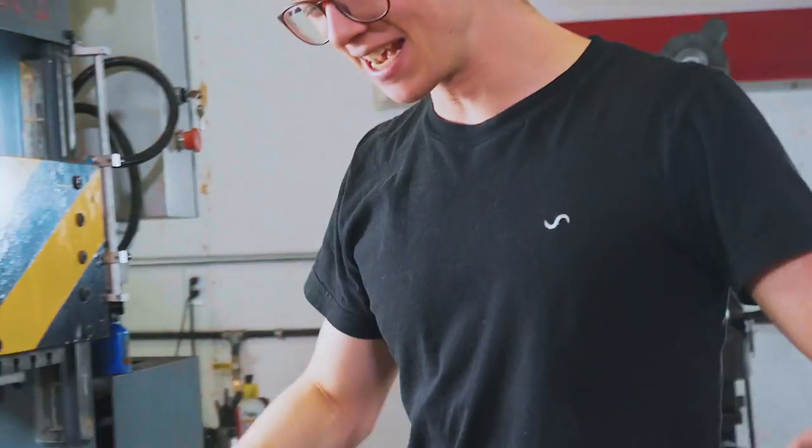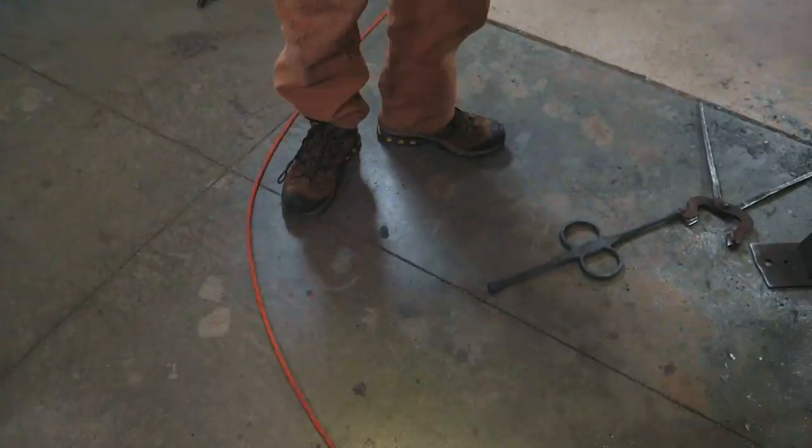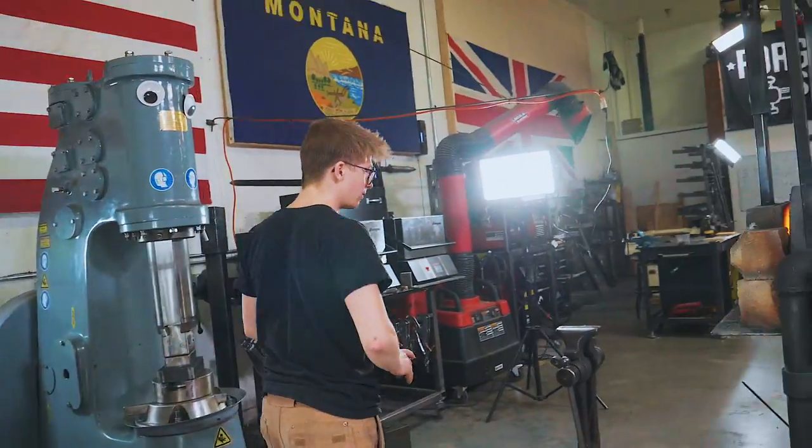That's okay. It's gonna be fine, guys. We're gonna survive. I know exactly what we're gonna do. The rest of the guard is all good. What we're gonna do is we're gonna turn up another ball that's threaded. We're gonna drill and tap into the end of the guards, and we're gonna just thread the balls in. It's gonna be a really easy way of doing it, and it would have saved us a lot of time if that had been something that we'd thought of in the first way that we went about doing this.